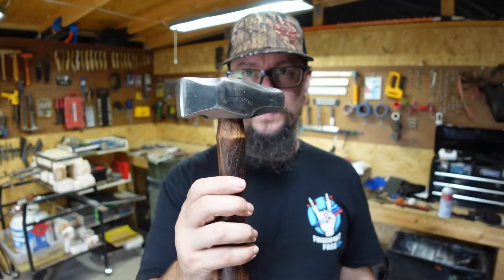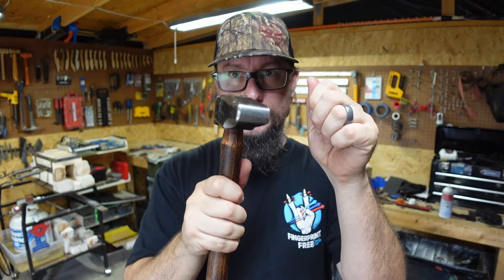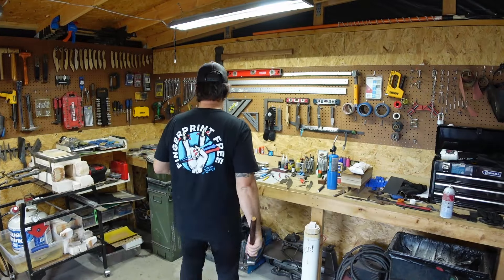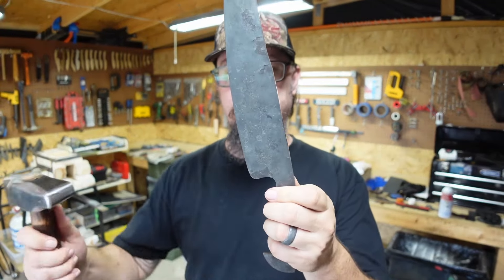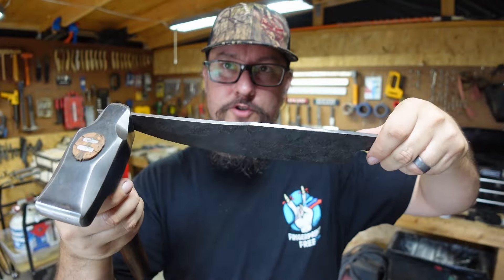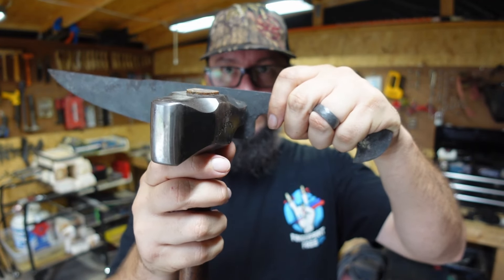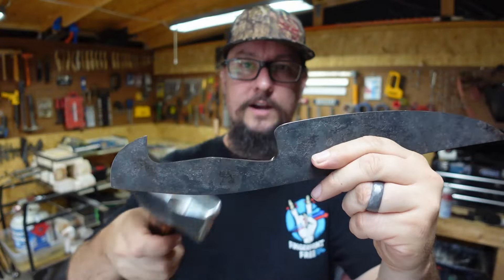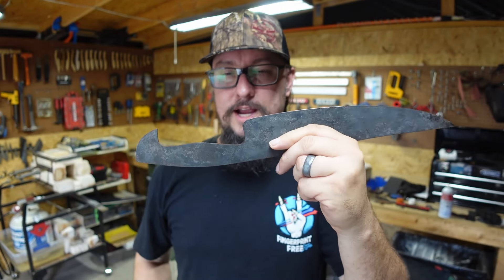This hammer helps with profiling, planishing, and moving things in certain directions. When it comes to a cross peen and straight peen, these are for specific things: we use the straight peen for stretching the steel lengthwise, and the cross peen for stretching the steel heightwise. For example, if we're trying to make this length on a knife, we use the straight peen and hammer all the way across to stretch it out. If we're trying to draw the heel down, we stake the hammer and pull that down.